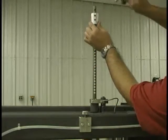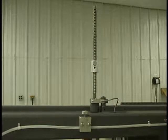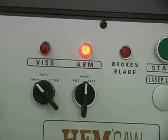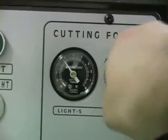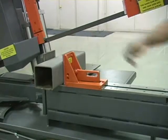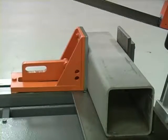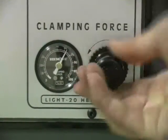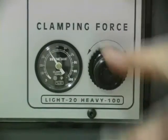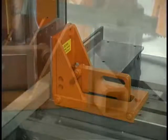To make a manual cut, adjust the arm height with the upper arm stop to have it close enough to the material so that the arm does not have too much free fall before starting the cut. Lift the arm by turning the arm switch over to the lift position. The feed rate and cutting pressure should also be correctly set for the material to be cut. Place the material in the vise making sure it is lying flat on the vise ways and in the cutting area. Turn the vise to the closed position. Always check the vise pressure to determine that it is sufficient to hold the part but not high enough to deform smaller sections or thinner walled material.